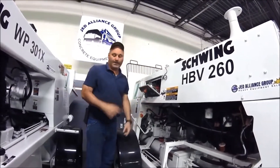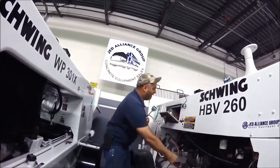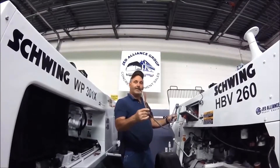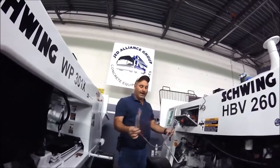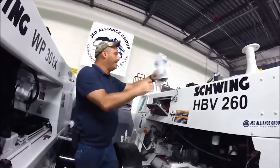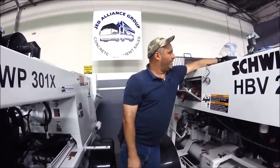I drill a small hole at the bottom and run your manual cable here, plug it in the machine, work it in the bottom of your box, put a little RTV over the hole so you don't have any moisture. And then you just wire it in directly instead of on the hardline cord. Then I route the antenna the same direction — I put it in a good area, usually right behind the muffler so you don't have any wind hitting it, and that goes right to the receiver.